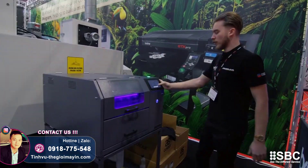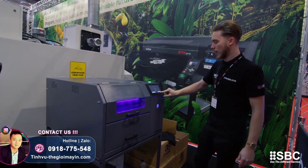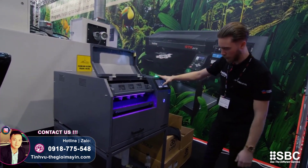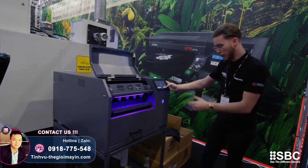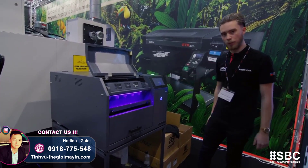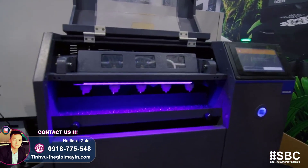Here we are back to the installation. Press OK and you can see whether your nozzles are good or bad just by pressing the water or pre-coating button, so you can check it before you load anything in. If it's good, press good, and it installs all of the lines of pre-treat — all automated, all done for you, nice and easy.